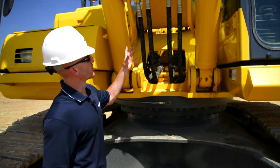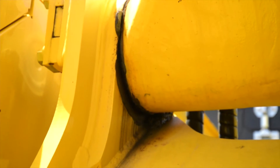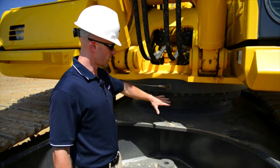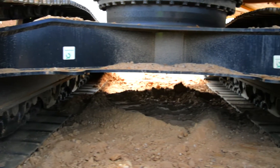After you've inspected all of your hydraulic lines, you can go ahead and take a look at the boom foot, make sure everything is receiving a proper amount of lubrication, as well as at your boom cylinders, your top hat, and your swing circle. This is also a good opportunity to go ahead and take a quick peek underneath the machine to see if you notice any signs of leaks.